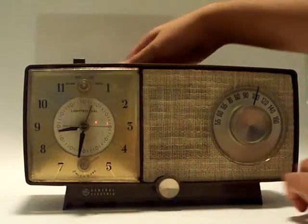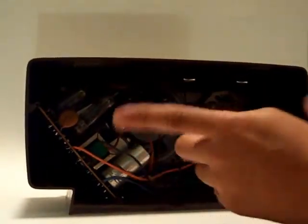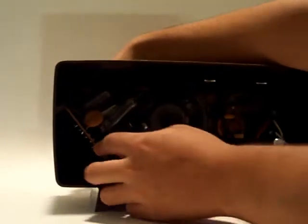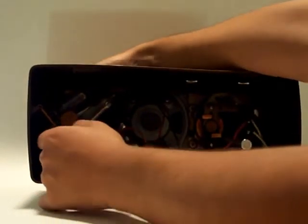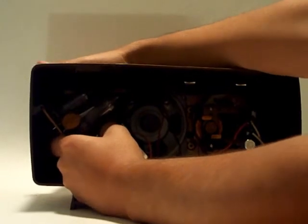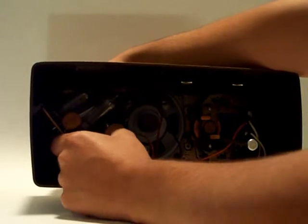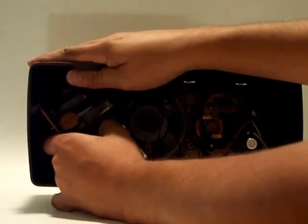Examining the inner workings. Let's look at this machine and turn it around. I took off the back panel already. Now, this is the chassis inside. With tubes, yes, vacuum tubes. Now keep in mind this chassis, the knob is held in with a metal bracket-like gasket on it. So do not pull it out from the front. Hold onto the front knob and hold onto the case back and forth by pulling on the chassis with the tubes.